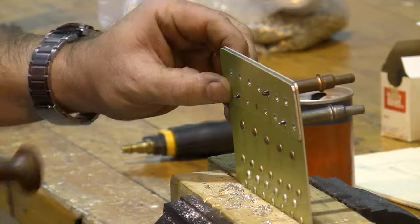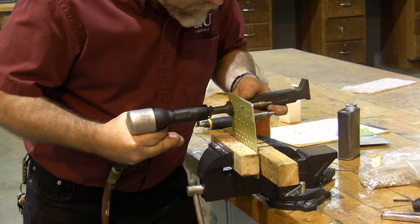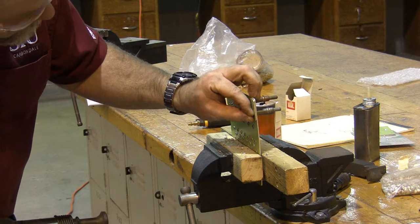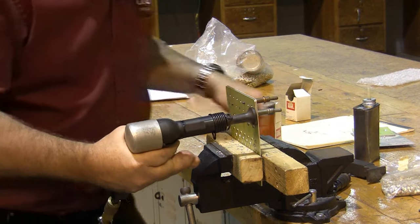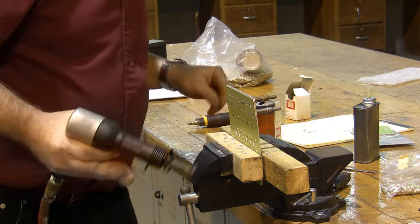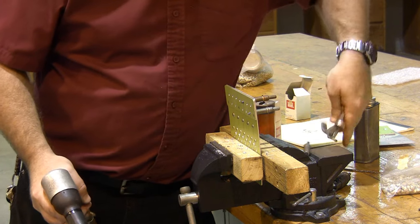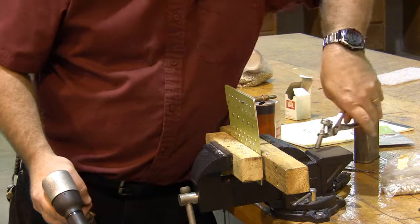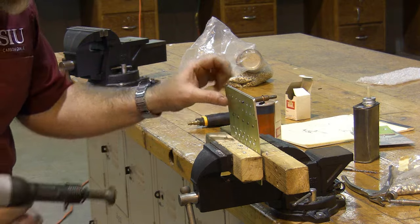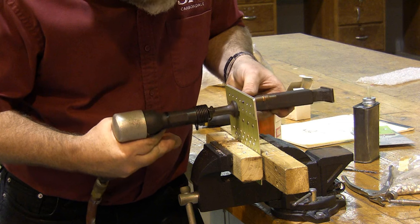I'm going to go ahead and put as many of these flush rivets in as I can. And then I'm going to stop and move my Clecos. I've got 3 in, that's good enough to stabilize that side with no Clecos. Clecos can come out. Additional rivets can go in. I personally like to kind of spread them out and not do them all in one area. I kind of work from one spot and then to a next spot and so on.